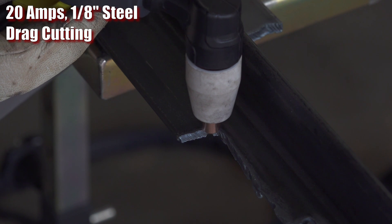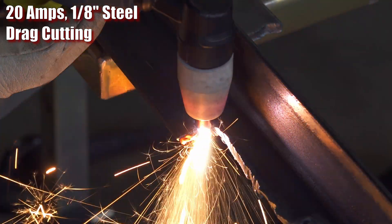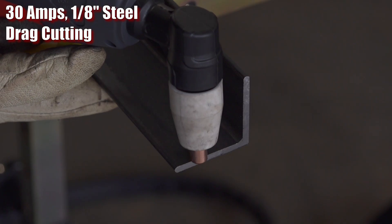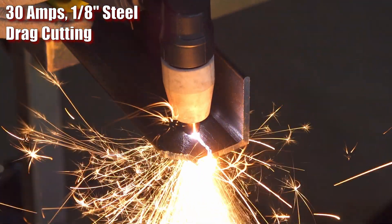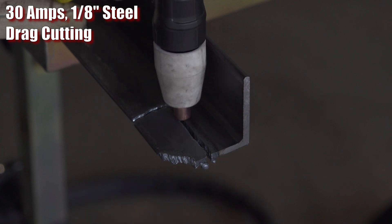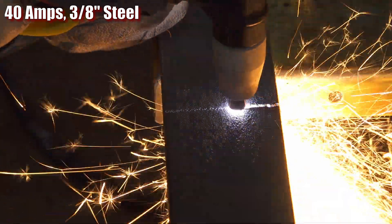If you turn the output down to 20 amps, once again it becomes more challenging to use because the arc goes out easily. In terms of air pressure, I ran about 75 PSI most of the time and never turned it up beyond that because the hose already looked like it was going to burst. I did try turning the pressure down — it cut surprisingly well with low pressure, but the arc wasn't any more reliable, and I don't recommend it because it burns up the nozzle and electrode pretty quickly. Overall it doesn't cut terribly, it's just more of a chore to use than other plasma cutters. A while back I tested a cheap Cut-50 plasma cutter with a pilot arc and it was much nicer to use. The MP200 is occasionally finicky when turned up and can be downright frustrating at lower output. It works, but personally I'd much rather have a separate small plasma cutter with a pilot arc and more consistent performance.